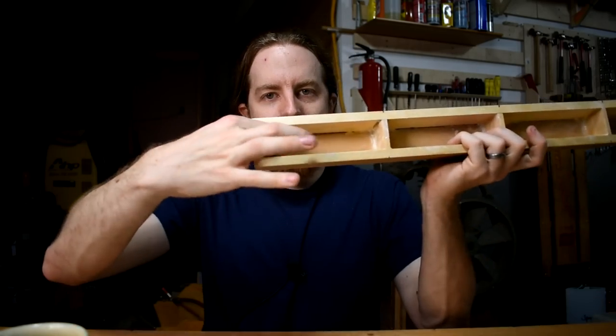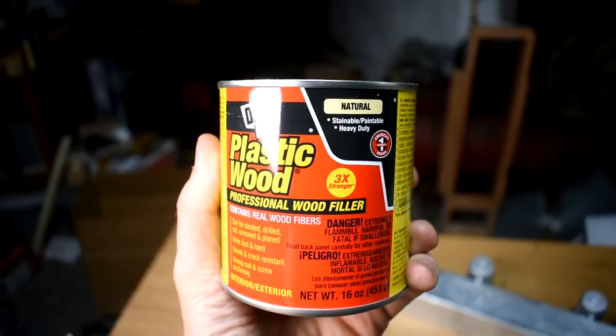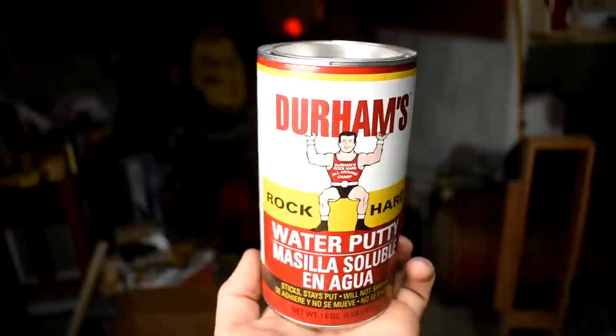But building it's not enough. You've got to sand the thing smooth and add fillets. The book talks about this. A fillet is basically where you've got harsh inside corners — you want to round those out. Gingery suggests using car body filler like Bondo, but I hate Bondo and Bondo dust hates me too. Feelings mutual. You might think wood filler, but wood filler is really difficult to get in there and smooth in a clean way. The best tip I got — thanks to Chirpy for this — is water putty.